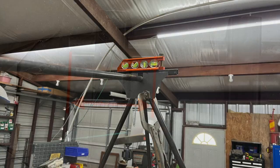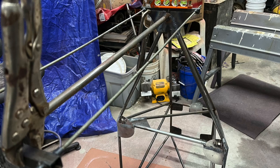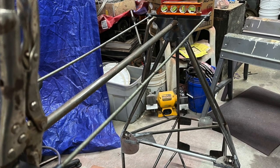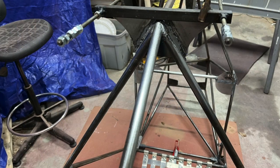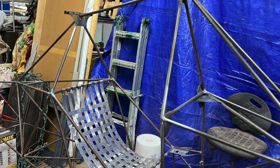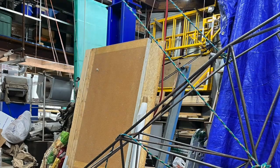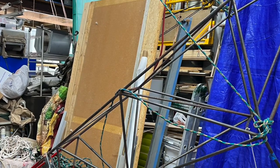I made sure the fuselage was level, then leveled the top bracket to the frame. Used the all thread from earlier, and I heavily tacked them in place. I then began starting at the tail, completely welding the frame, tying all those ugly tacks together. Remember, when welding, don't forget to bounce around from cluster to cluster so that you won't warp your fuselage.